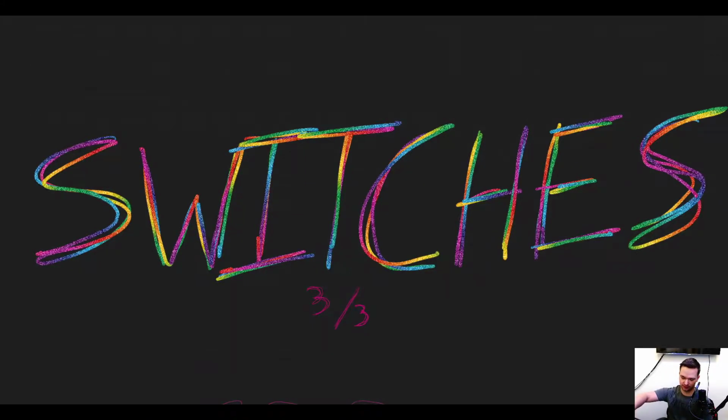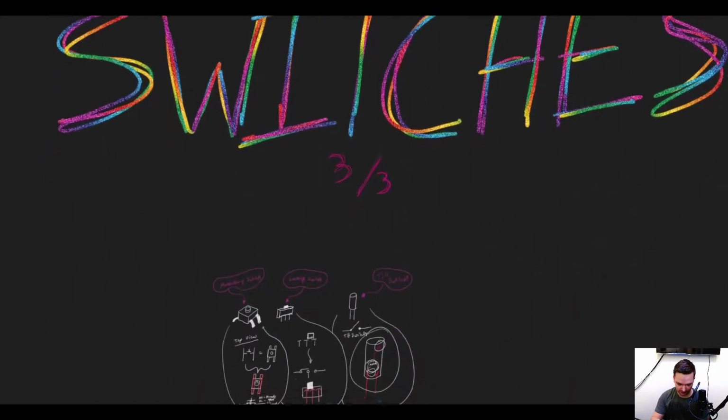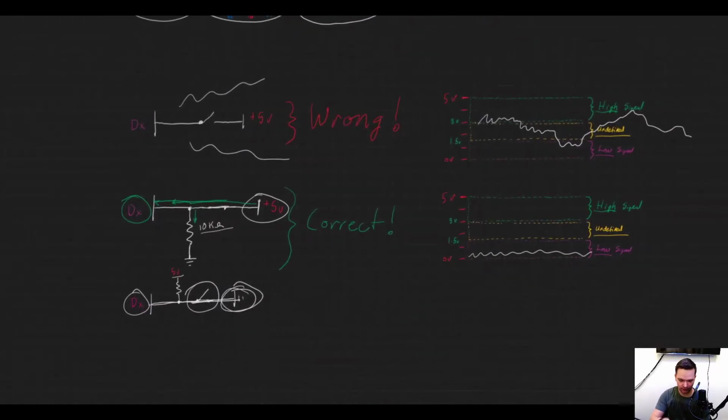All right, 3 out of 3, the third video in our switches set. We've covered 2 other videos previously. In the first video we talked about some basic kinds of switches, 2 really main ones, which are a momentary switch and our latching switch, and then a special case, which is our tilt switch. Then we talked about why we need a pull-down resistor in that switch and the right way and the wrong way to attach a switch to anything that's trying to read a signal.